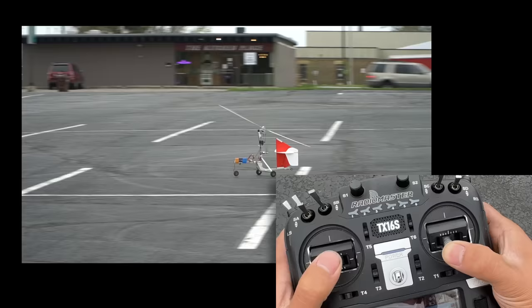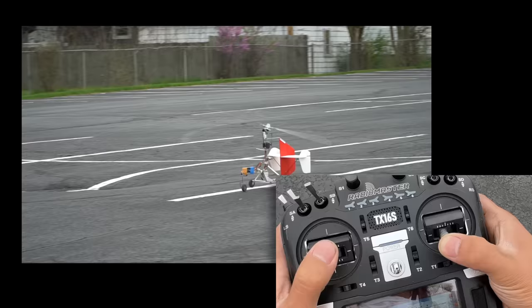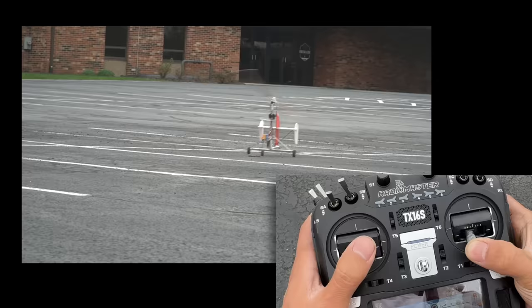But what you're looking for is this thing called wheel bounce, where the gyrocopter is bouncing between the rear wheel and the front wheel, just bouncing on the mains, is what it's called. Once you're bouncing on the mains, simply add just a little bit more power, and soon the gyrocopter will unstick from the ground and begin flying.